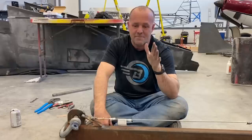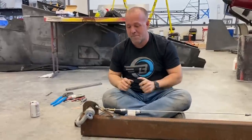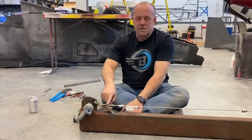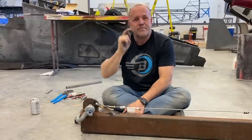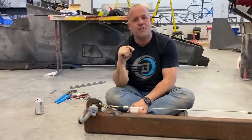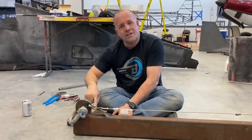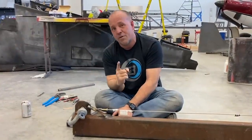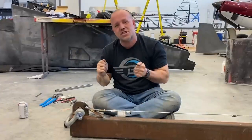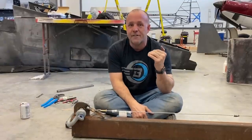And I'm gonna describe the difference. The point at which it shows failure might be this component starts to arc. If that arcs, I'm calling a failure. It should not deform. If it's starting to deform, I've already exceeded the limits I need to hit. If this bolt starts to bend, that's a failure even if it didn't break. Anything that changes shape and does not return when the pressure is released is a complete failure.